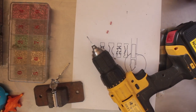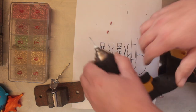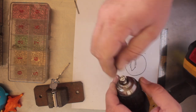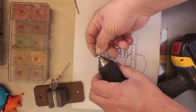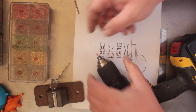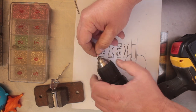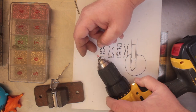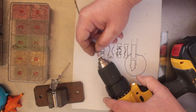To make driver spool or mushroom pins, you're going to need a drill with a fairly tight chuck on it, and some little tiny warding files. This one I drilled through some silicon yesterday so it's not the nicest but it will do. I'm going to put a number nine pin in there. It takes a little bit of effort to get it lined up — if you're lucky enough to have a jeweler's lathe you'll find this easy. We need it spinning true, meaning nicely centered. You can also buy a little tiny chuck off eBay if you wish.